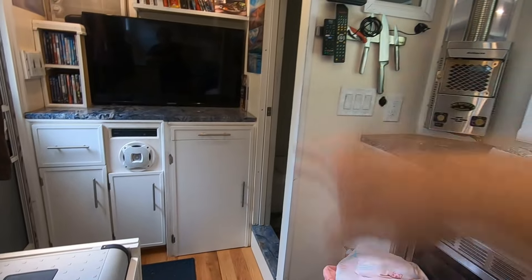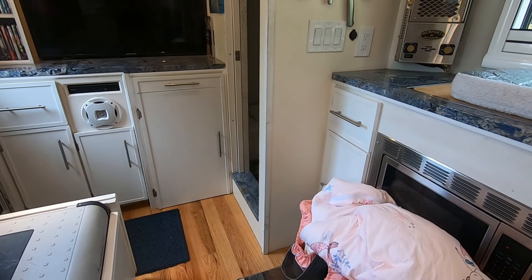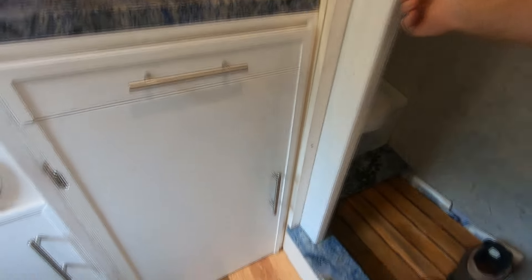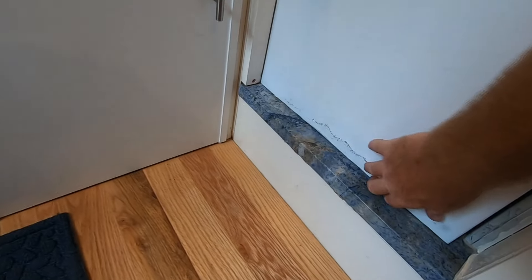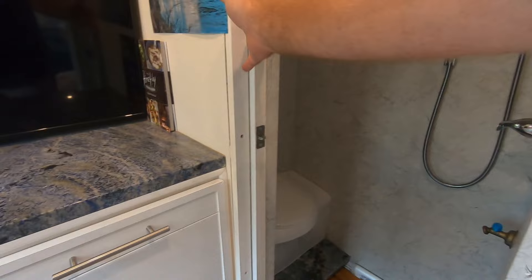The other thing I want to do in here — I need to redo the door. When I built it I thought I had sealed it with epoxy, but we're starting to get some water damage; it's soaking in on the bottom edge. I'm going to take it apart and redo that door with epoxy or a RedGard combination, and maybe raise it up a bit so it doesn't wick water up into it.